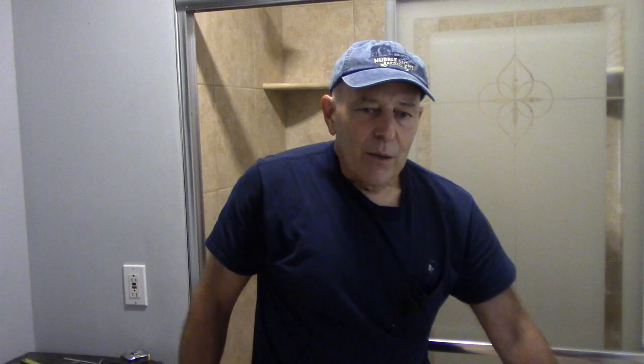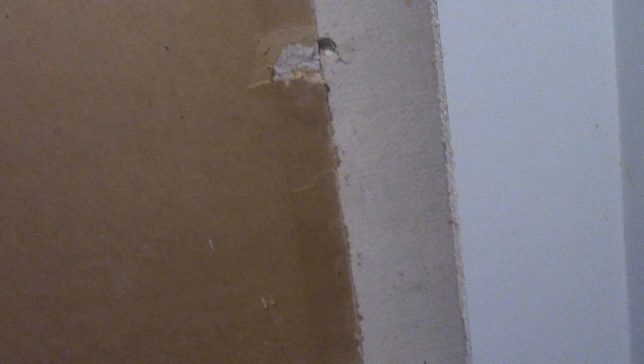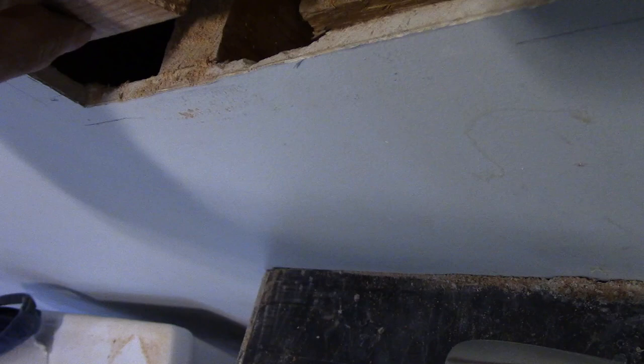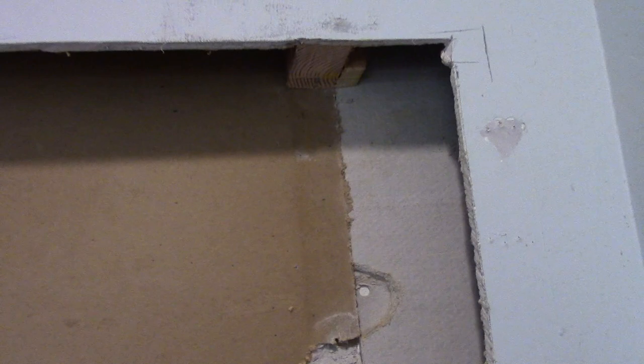So let me cut that out. Once it's cut out, we'll come right back and we'll get this installed. So now we have the opening cut out. We cut it 29 and one half inches. The cabinet itself is 30 inches, so that'll give us a little bit of a half inch leeway. We're going to take our two by four and we're going to cut a two by four and we're going to put it in here to the wall and we're going to screw it into that stud right there. Then we're going to put a screw right through here into the other part, which is going to be inside here. We'll put this down flush and put a screw into it so that it's a nice straight, even box. We're going to put a two by four in here and box the whole thing out and then we'll put the unit in.